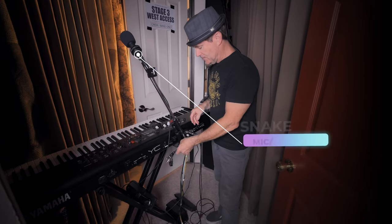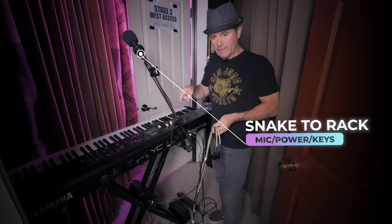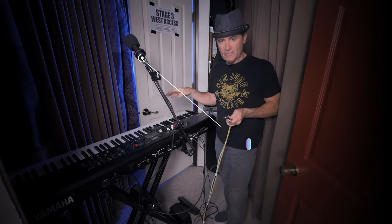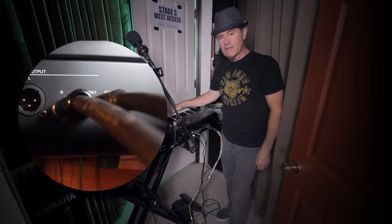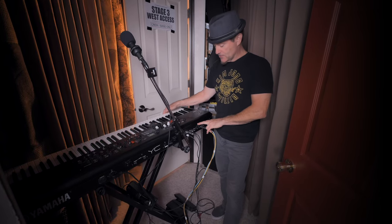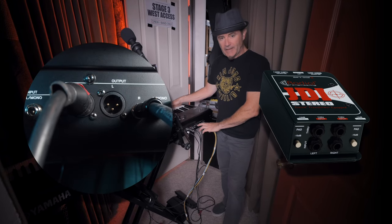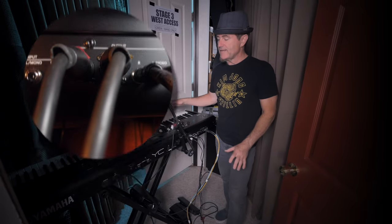The last set of connections is just a simple snake. I have a snake that's wired together and it's got my mic cable in it, then it's got power to the board, and then my two left and right audio outs to my onstage rack that allows me to control my onstage sound with my onstage EQs. And then the final set of connections are the left and right XLR outputs that go direct to front of house. These are a godsend — I no longer have to rely on each venue to have a high quality, maybe Radial, stereo direct box. The front of house guy just takes my left and right XLR feeds directly out of the DIs on the board. They're hum and buzz free and they sound perfect every time.